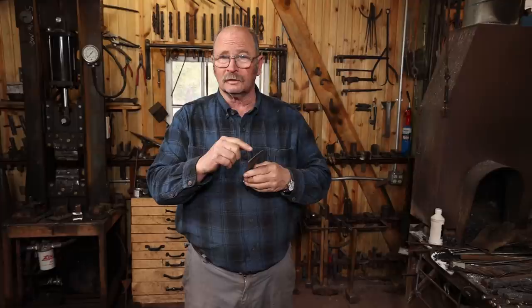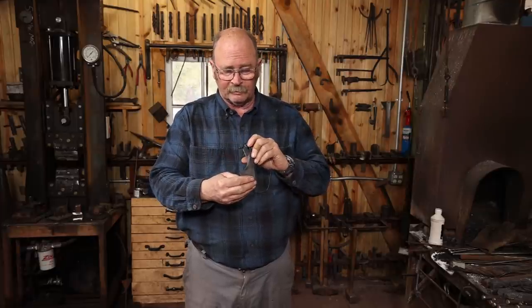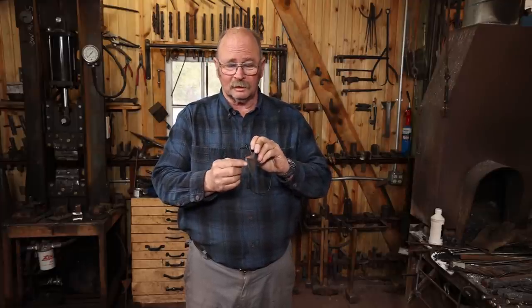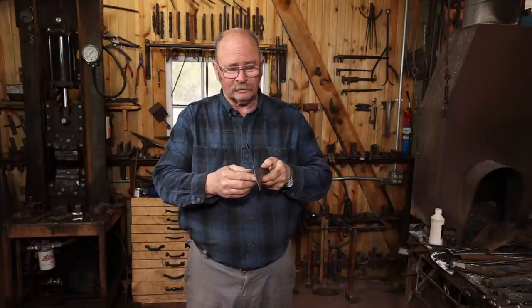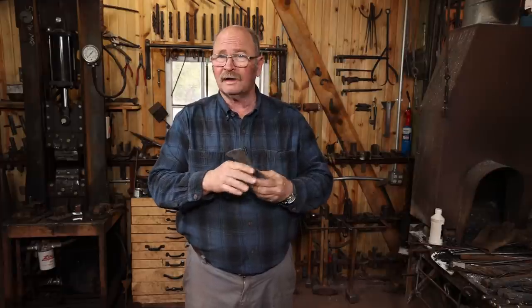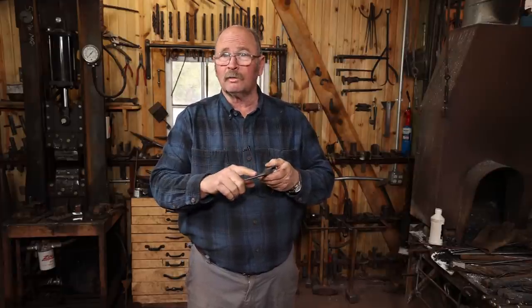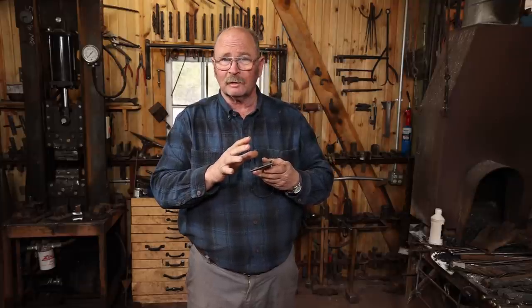and that is that the weld for the cutting edge failed in the quench. I don't remember seeing that previously, but at some point it split right up along that. And that means this axe is just absolute trash, completely useless at this point. Not even worth trying to save it. But I'm gonna go ahead and polish up the good side just so we can see what that pattern looks like on the Damascus axe.